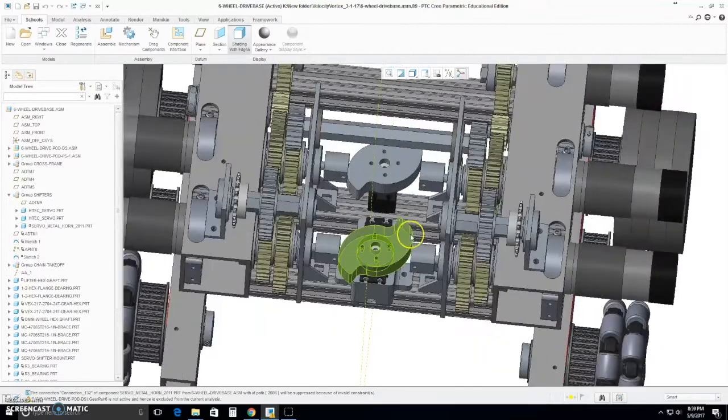For our actual shifting, we're using spring-loaded shifters on the outside with a cam in the middle. We went through many different versions of different shifter designs. At first we started with a linkage that would pull the shifters in and out, but we found that the linkage often had issues because it would more pull the shifter to the side rather than straight in and out. And so this led us to developing a rack style design, and we 3D printed a rack piece so we could have a gear on the central servo that could pull both shifters in and out at the same time. But this also led to problems because our printed part was breaking the teeth off of the rack. So this led us to switch over to a cam based method.